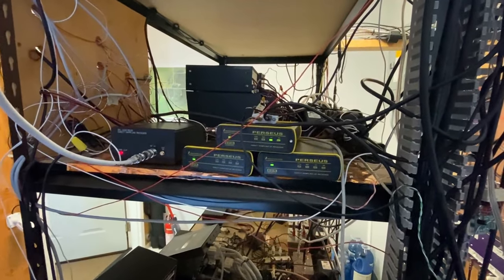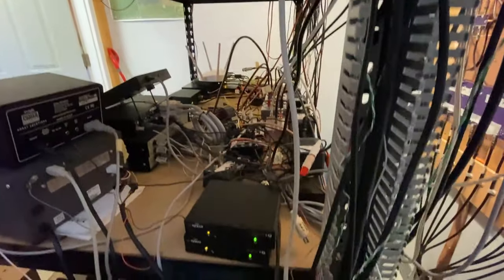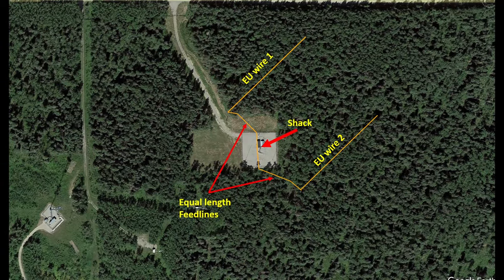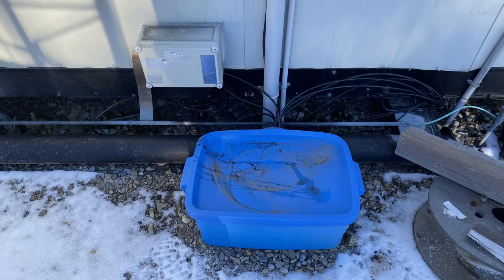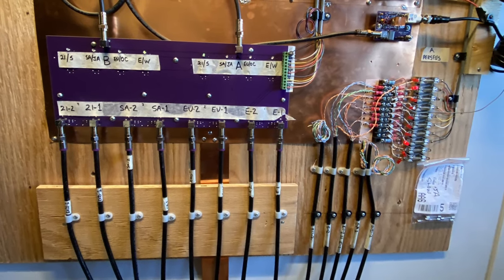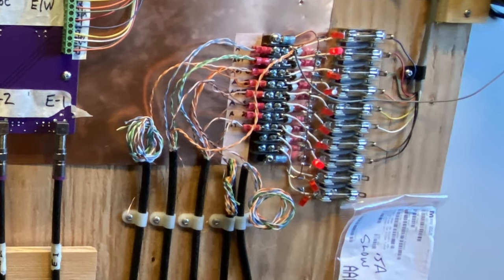Since I have multiple SDR radios that I use for both medium wave recording and skimming spots to the RBN network, I wanted to have all, or most, directions available in the shack to route to any one radio. Each BOG wire has an equal length feed line that runs back to the shack. Any extra length required to make the lines equal is rolled up in this bin. These feed lines all have to be electrically equal since I'm phasing them in phase. The wires enter the shack, and each feed line is connected to this combiner-splitter selection board. These cables to the right are my CAT5 control lines for power and switching to each BOG.